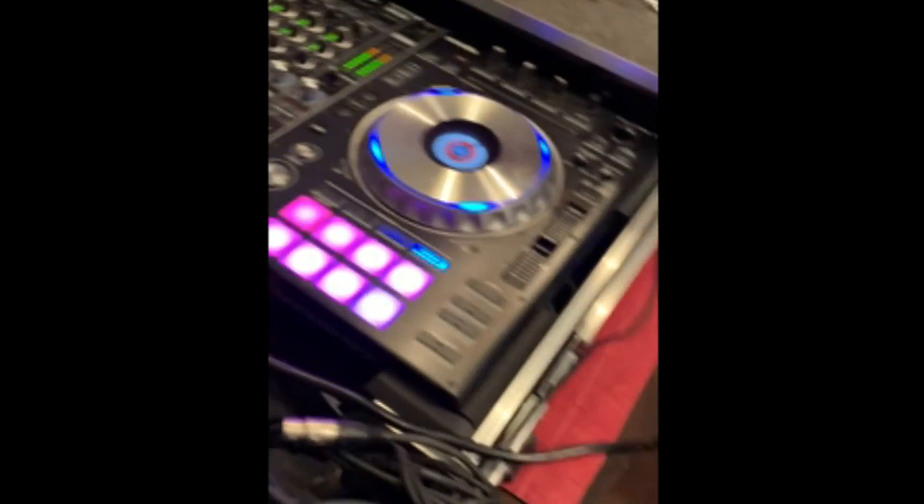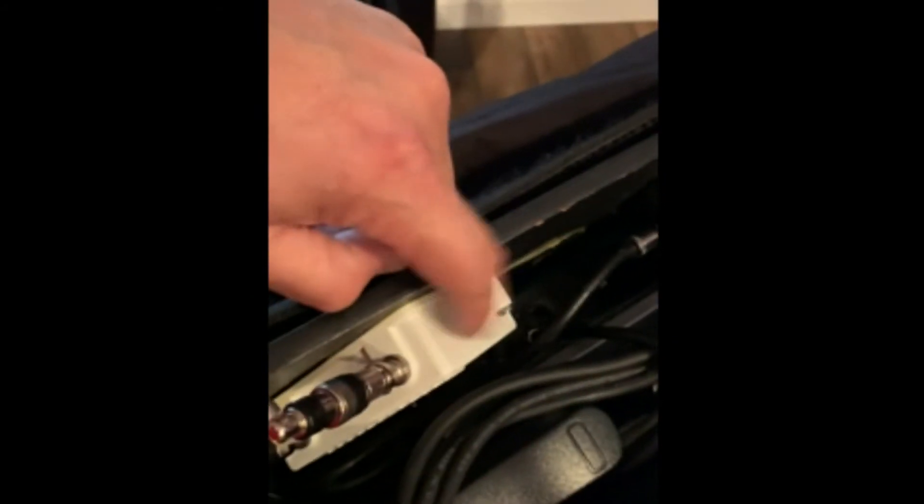The very important thing that I did — let me squeeze this a little bit — is I did a big modification here. I put two amplifiers. These are TV antenna amplifiers. I put two from the outside of the receiver to this one and the other two on this one. So right now we are amplifying the reception to the receiver. I've been doing a couple of tests and this works perfectly.